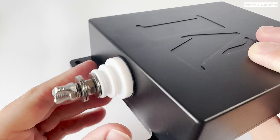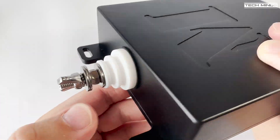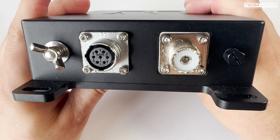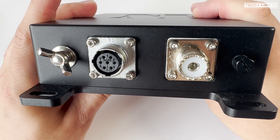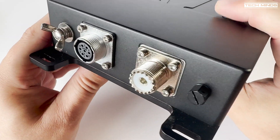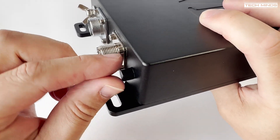The main radiating element is attached to the MAT40 through a wing nut on top of the isolator. On the other end of the MAT40 we find an earth lug for your earthing system, a control interface socket where the control cable plugs in, and lastly an SO239 socket for the 50 ohm coax feeder from your transceiver.